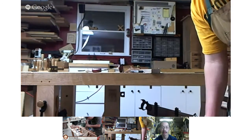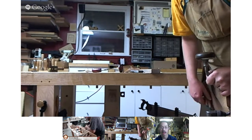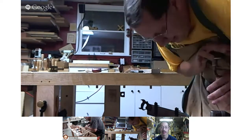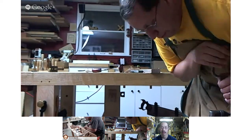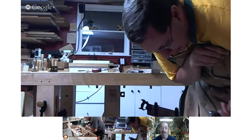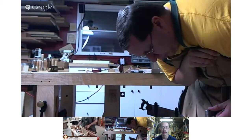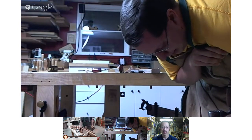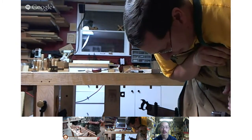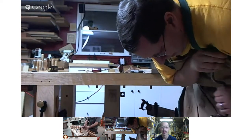I've never actually seen anybody do that in competition, though, because it's silly looking. And I guess people are embarrassed. So what I do is I put my shoulder right on the pad, and I'm out over it a little bit more, but I've got a better feel. I can now sight back along the bit, and I can see if I'm square from side to side. And then I can tilt my head a little bit around, and I can see if I'm square the other direction. And you can generally get a pretty good feel.